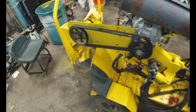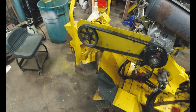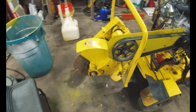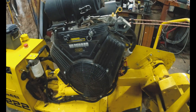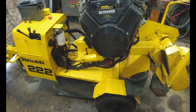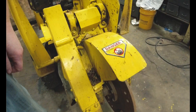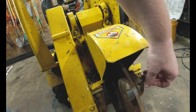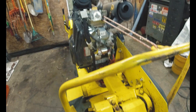If you haven't seen it before, this is my rebuilt Vermeer 222. It has a Briggs and Stratton Vanguard 35 horsepower engine that we repowered this with. This thing's a beast — it's done some really good work. But the teeth I have on it are just regular finger teeth, which have been doing pretty good, but I just need a little bit better cutting surface, so I've switched to the Green Teeth and I'm going to install those today.